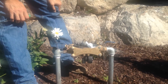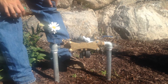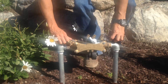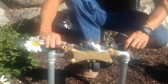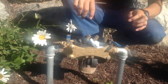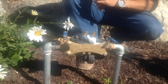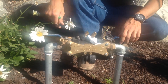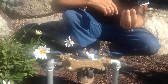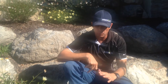That's all you need to do to winterize your sprinkler system hooked up to a culinary water supply. It's extremely, extremely important that you do not close these two blue handles. If you were to close those handles, it traps a little bit of water in these areas and it will pretty much 100% of the time freeze and break. So let's leave those open all winter and allow the water to spill out. Your system's automatic drains will then be able to open up and release the rest of the water.